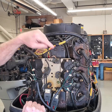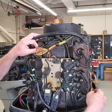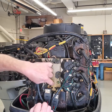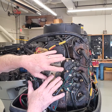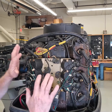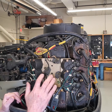There are two 20-amp regulators behind this panel. They are attached to the exhaust manifold, which acts as a heat sink where the water's coming back through. What was really nice about this engine — and I thought this was a great concept — was they put one set of stator windings off one half of the stator into one voltage regulator, a rectifier-slash-regulator. You have your output, one red lead that comes off of that, coming around to the starter, giving you 20 amps. You have another leg — a whole other set of windings, the other part of the stator — going to the lower voltage regulator. So you have two 20-amp AC circuits creating 20 amps DC and 20 amps DC to give you a full 40-amp output from a single outboard. And if you lost one stator lead or one set of windings, you'd lose the first 20-amp leg but still have 20 amps.